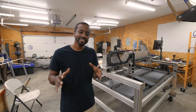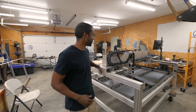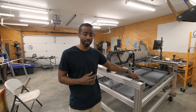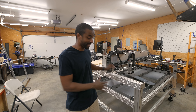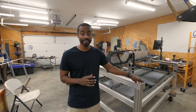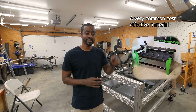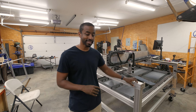The scale of this project is huge, so we're going to start by just talking about the frame and the overall design. Every CNC machine has the same basic anatomy: there is a rectangular box with linear rails of some sort which allow a head to move above the part underneath. There are lots of videos already on things like ball screw versus gear teeth, so I'm not going to get into that too much here, although for the size table that I have, gears were definitely the way to go. One of the things I want to cover is this extruded aluminum that the table was made out of — this stuff is ridiculously expensive to buy new. My original design was sheet metal, because having all the parts custom made and bent locally was still cheaper than this extruded aluminum.